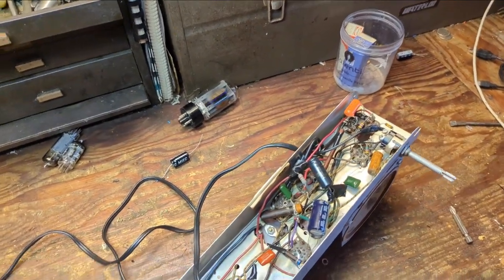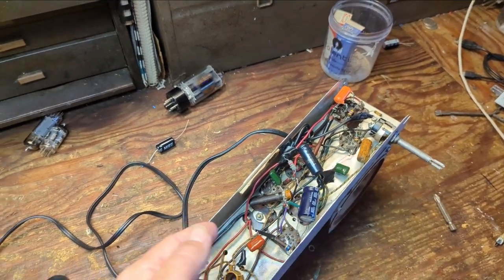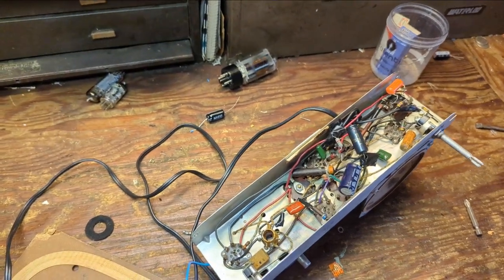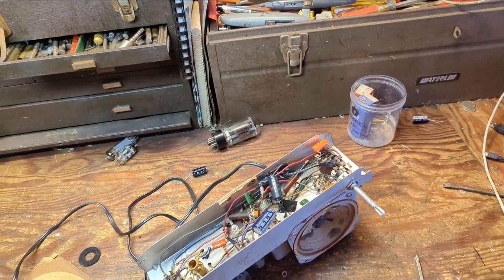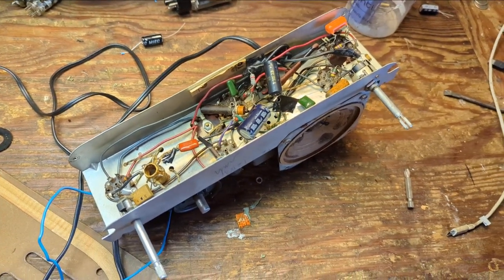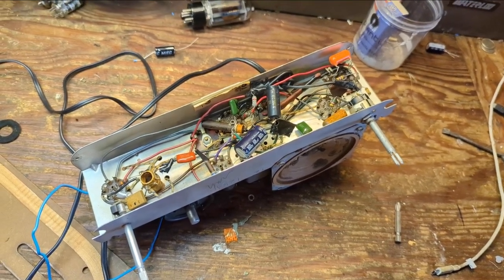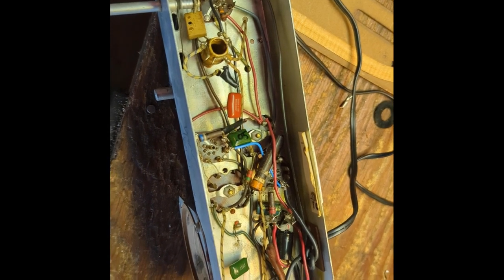What I'm going to do is replace these two caps with two 47 µF 160-volt caps, replace this with a safety cap, and cinch some of these excessively long leads. Basically I'm going to recap the recapping job. Then we're going to add the audio input feature — that's going to allow the user to run their audio through the set, with the ability to switch the radio signal on and off. So let's start that process.